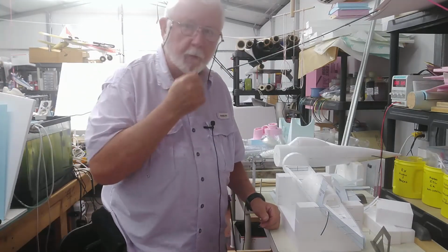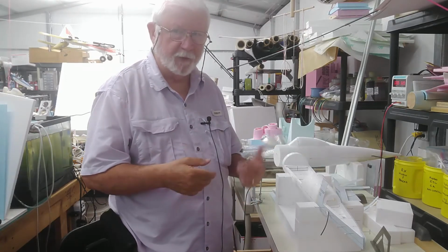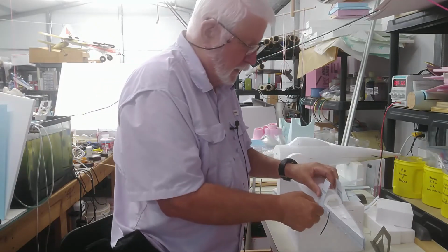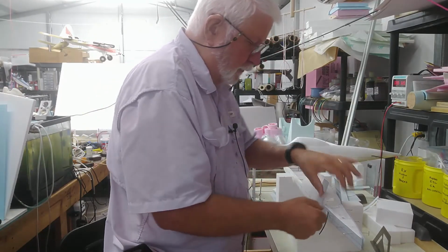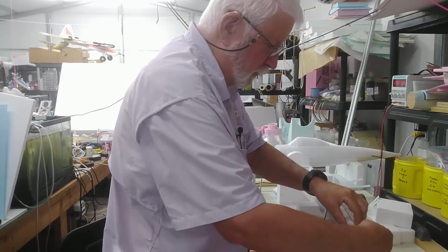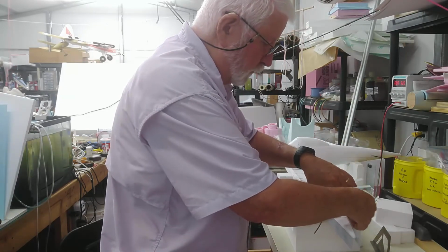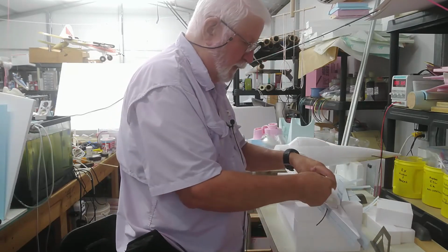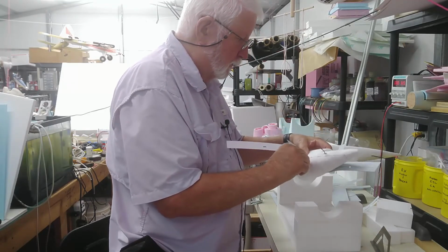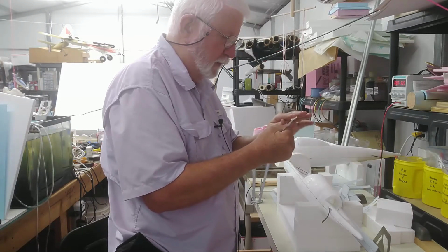But what we'll talk about in the remainder of this video now is filler, and I'll give you a couple of recipes that I found that work for me, because of course in order to do these cuts we couldn't put any filler on this foam. That would really mess up the wire's ability to go through it. We just wouldn't be able to do the cuts. It would hit some of this hard filler, and the wire would stop, and you don't want that. So what we've got to do, because again this is EPS foam, and EPS foam is full of big divots.